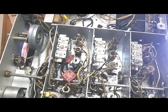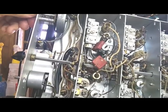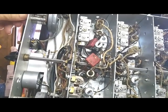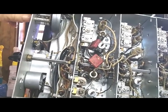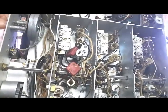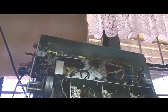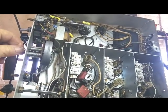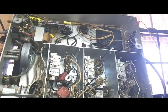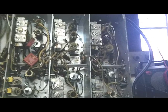So I'm going to switch to band 2. That was the other one I've repaired. Not a lot to listen to on band 2. It's 10:30 in the morning, and that band 2 covers from 1.7 to 4.5, so not a lot there, but the receiver is definitely hot now. So band 2 is repaired. Bands 1, 2, and 5 are repaired and working. So now we only have to do 3 and 4. So we'll go to work on those.